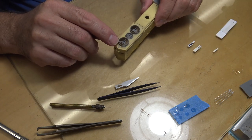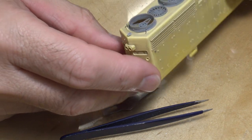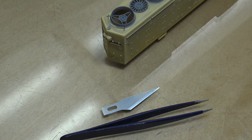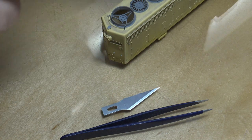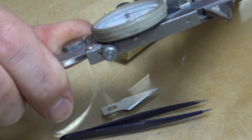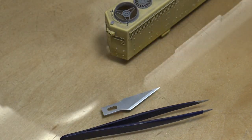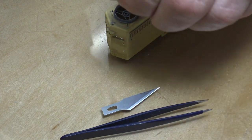Now I've got the fan grab in. So I've got that in. You can see that I use this spacer. I have written on it fan grab. And that measures, real quick, for anybody that wants to know, I gotta fix my dial here. There we go. Okay, that measures out to be 0.079. You could use 0.08. That's fine. 80 thousandths, because I think that's what this is. It's just sometimes the thickness isn't uniform all the way down. So that's an 80 thou by 40 thou piece, and I just use it as a spacer for the fan